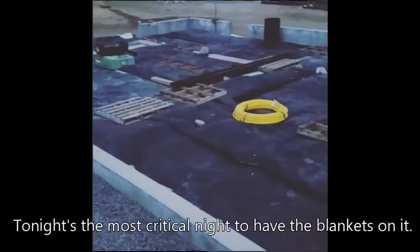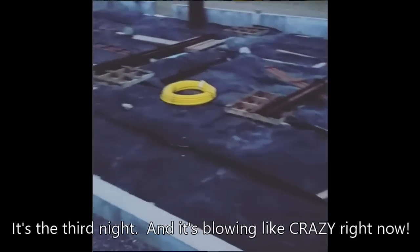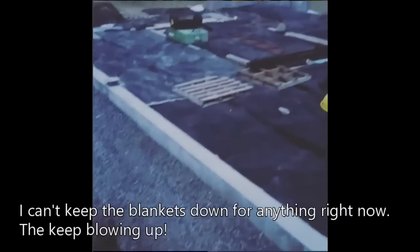The floor actually turned out really good — I couldn't be happier with a lot of aspects of it. It was exothermal for a couple of nights. Then on the third night a cold front came in. This is the critical one for the floor not to freeze — it's going to be like 17 degrees. We've got six concrete blankets. It's been stressful to say the least, but I think we made it. I put some boards in here to handle the expansion and contraction of freezing until I get other concrete in with a proper expansion joint.